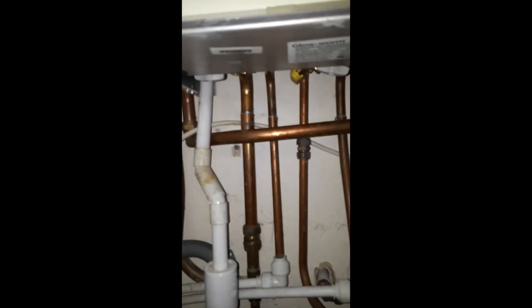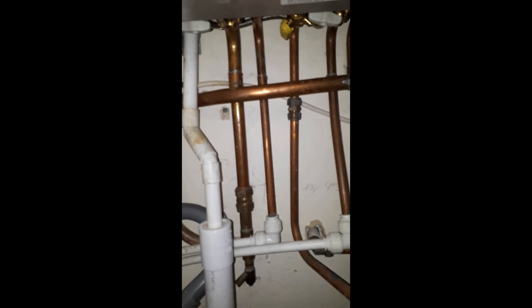If all that's good, fill your boiler pressure up. If you're using the filling loop and you've got a gauge, go to about 1 to 1.5 bar with the heating system water cold.